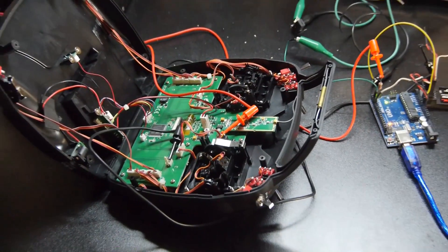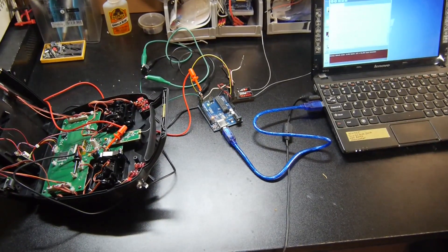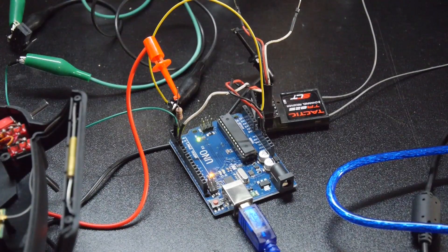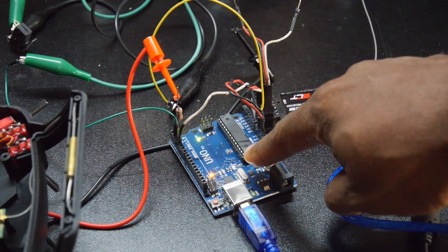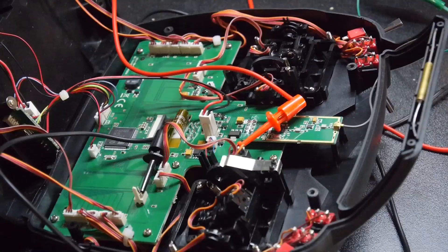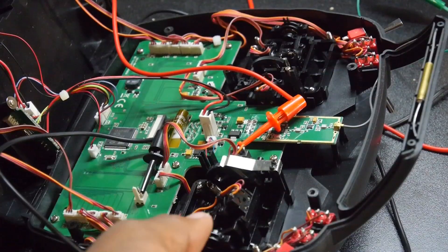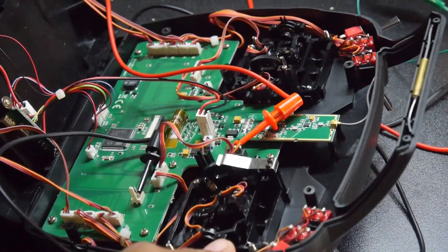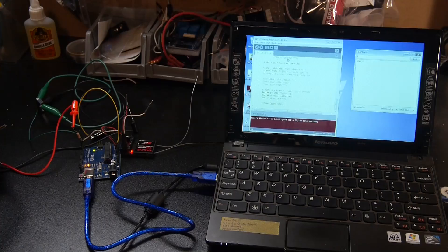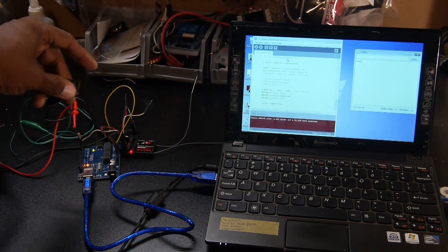This allowed me to connect up an Arduino microcontroller directly to both the transmitter and receiver at the same time. I will use the Arduino to monitor the output of the receiver and trigger the throttle channel of the transmitter at the same time. In this case, the Arduino is connected to the potentiometer on the throttle stick gimbal, which is where I will inject a signal voltage. A micro switch is used to trigger the Arduino to start the latency measuring program.